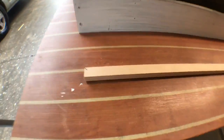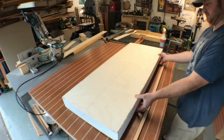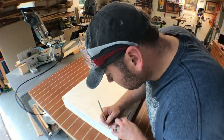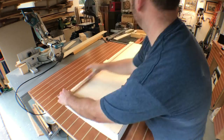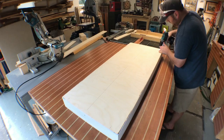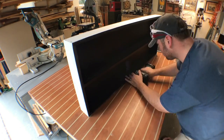There's the cabinet and the window. This is a story stick that tells me exactly where my studs are in the bathroom. I'm gonna flip this over, put that story stick on the back of this cabinet, put some spacer blocks to give me reference between the top and the bottom, and transfer those marks. That way when I install this I know exactly where to drill. As I drill these holes from the back, I flip it up and realize the holes need to be a little bigger, so I take a larger diameter drill bit and finish the job.